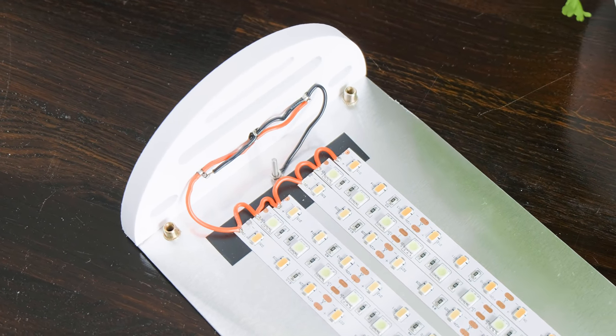To finish things off, some PVC arches are added, which clamp over the acetate once screwed down, and any overlapping acetate is trimmed off. Adding this acetate covering not only protects the LEDs and diffuses the light, but it also makes the entire light rigid and unbendable, which is excellent considering they weigh only 700g. Once you've finished the others, they can be used for either home lighting or studio lighting. To mount them onto a wall you can simply use a couple of nails, but if you want to mount them on a light stand it's just a case of making a quick frame out of aluminium angles. There are three power sockets on each light, which allows them to be daisy chained together from just one power supply.